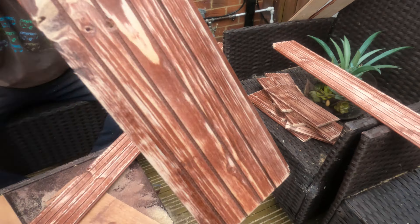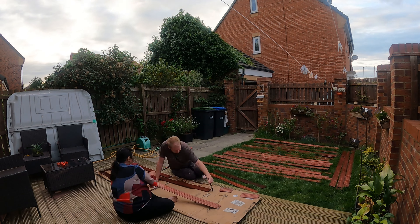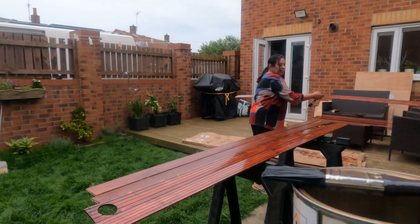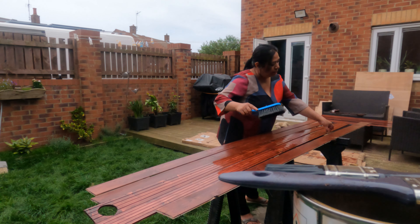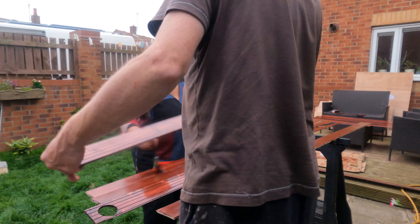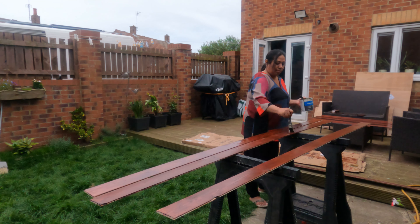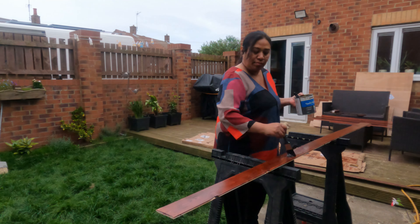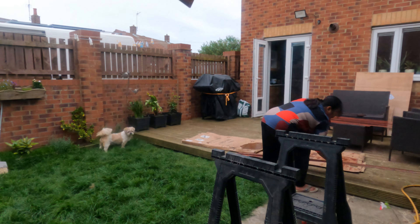After applying a couple of layers of varnish we decided to sand it back in a very patchy manner, then reapplied another layer. This gave it a more patchy look rather than a solid colour. We then put on top of that a yacht varnish to give it a clear gloss, so there's a bit of shine to the ceiling. The whole process took quite some time but it really was worth it.